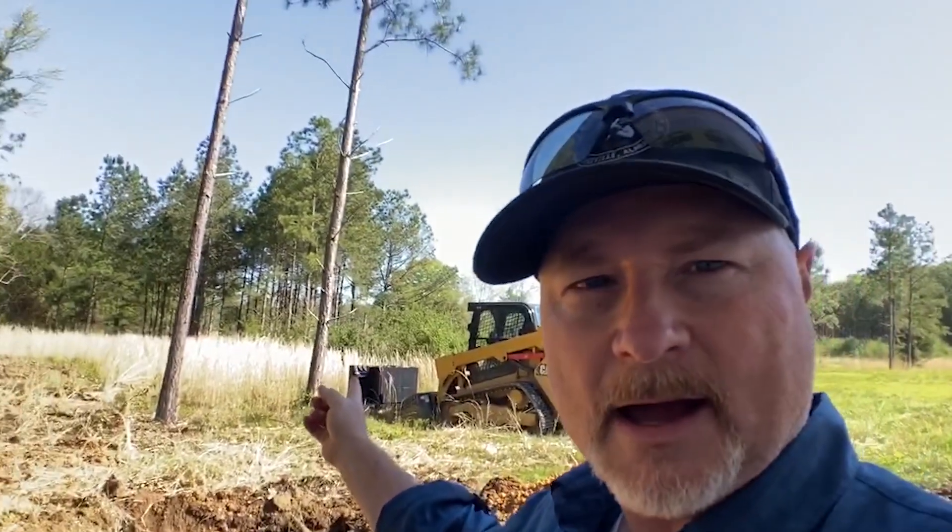We have put a pump over at the creek and we're going to pull water into the tank when we get it in. But I'm thinking we're probably going to have to initially start with putting the pump in here and pumping some of this water out. Eventually he'll set the tank into the hole and we will fill that tank up with water. Then he's going to dig out the trench lines — the field lines. We're using the half-shell hard plastic ribbed field lines instead of the old-style PVC. These are the new ones, so these aren't going to go out near as far.